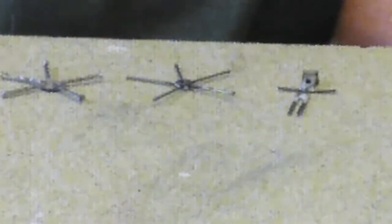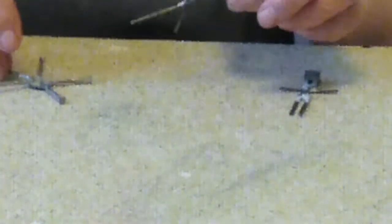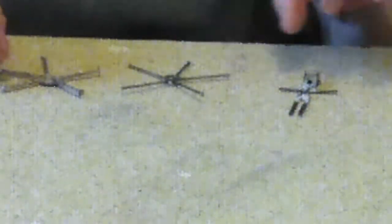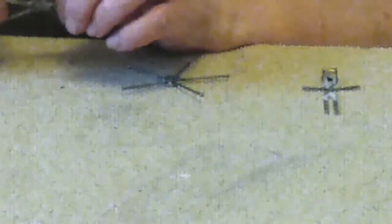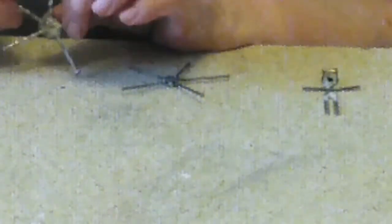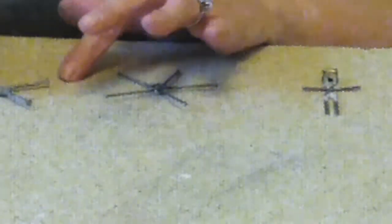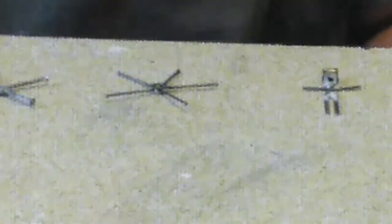Here we are back again in the blink of an eye for you, and I have more or less cleaned these up. I don't want them to be real clean. They're going to be rustic looking, and I'm okay with that. I put them in a pickling solution. Pickle is just something that is used to clean up the metal. It removes fire scale. There is a different pickle that you use for anything with steel in it, because the pickle that you use for copper and brass and silver is inactivated when you use steel in it.